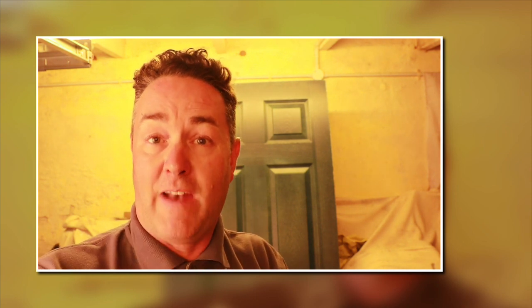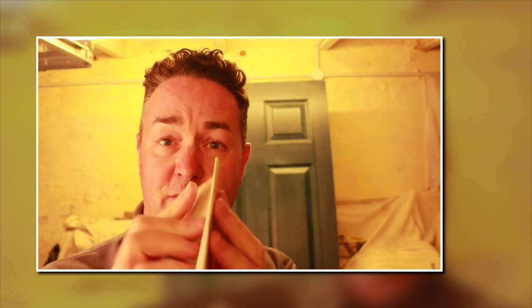A rubbing block gives you a flat surface when you need to rub something down smooth. For rubbing down a door, though, I don't need a block — I can mould the sandpaper with my fingers and bend it to get into the mouldings nicely. The beauty of this type of sandpaper is it's flexible and doesn't break down on you.